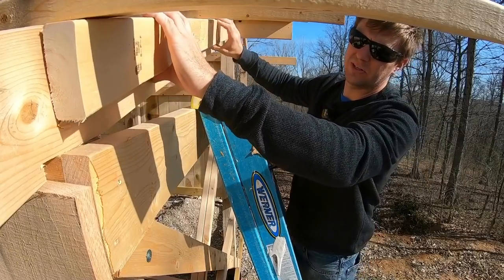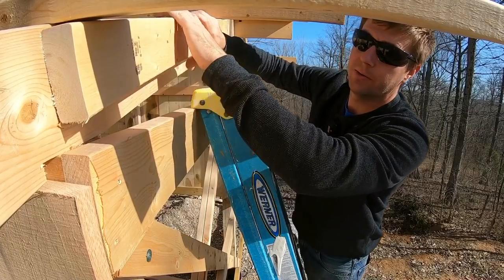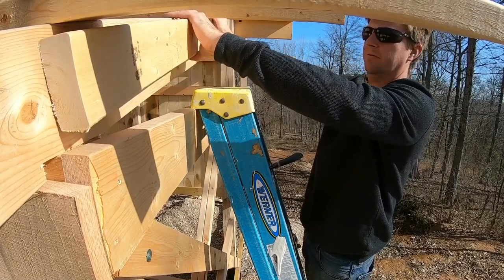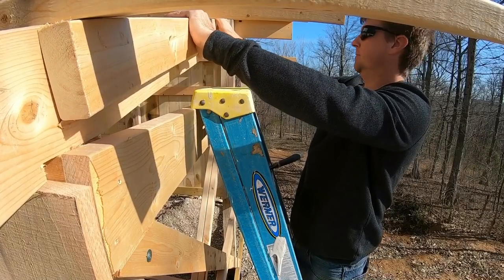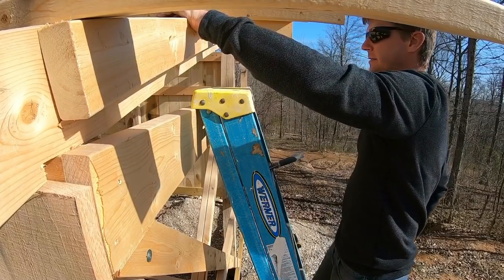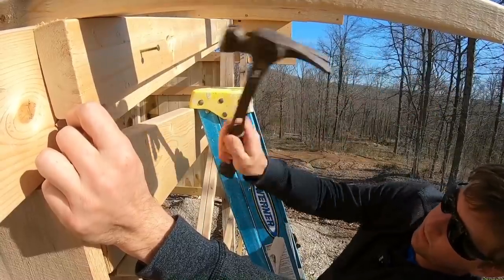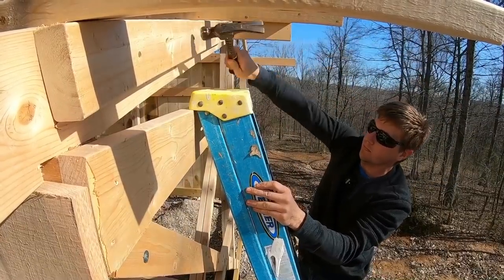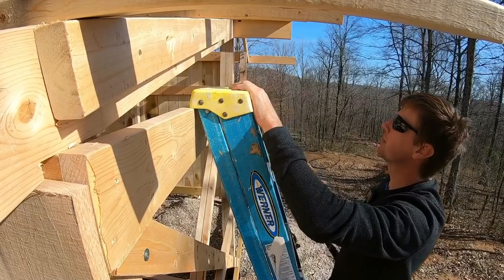These are the pieces we just got cut off. We'll nail those right there so that this is flush with that. Just gotta use it for some blocking for how that siding's gonna fit on there. It doesn't have to be perfect. Just kinda needs to sit up there for me. You gotta compact the wood around the nail.